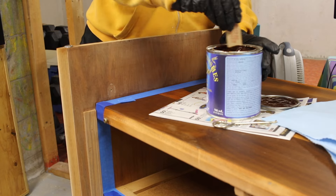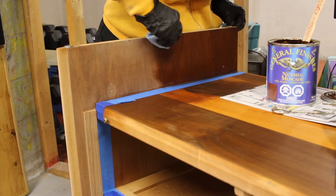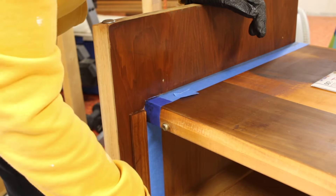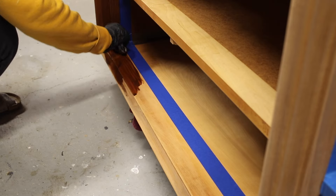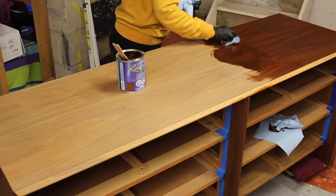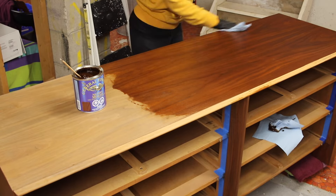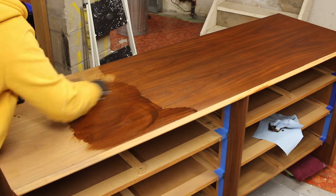I'm finally ready for the stain and I chose Nutmeg for its nice warm brown. The reason I added a stain is that normally you don't really have to stain walnut because it has its own really nice natural color, but I had to do quite a bit of lightening on the top of the dresser with oxalic acid because of the black stain. So I decided to stain it in order to even the color out everywhere. One of my favorite stains is General Finishes Nutmeg — I love the color on walnut. It gives it that nice rich brown, and it goes on really smooth without drying fast, so you don't get streaking. It's just a pleasure to use.